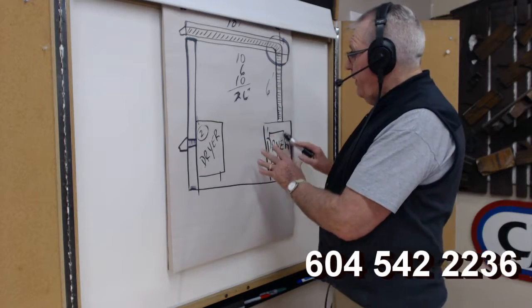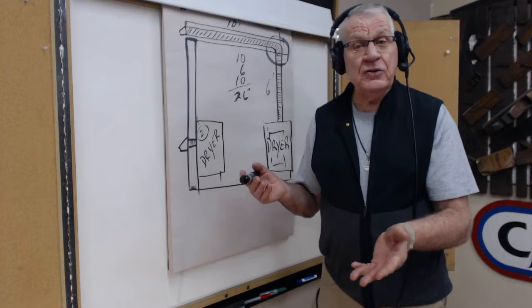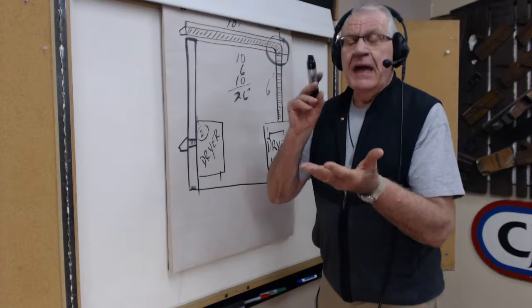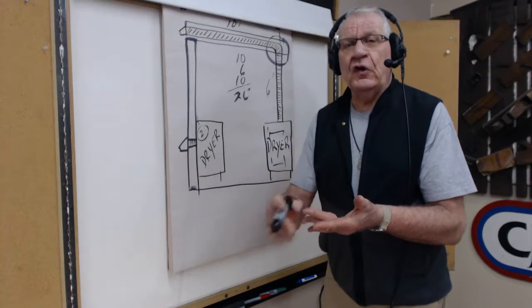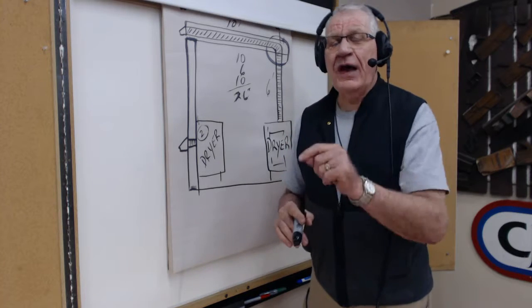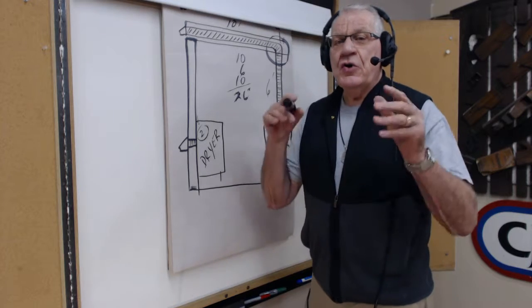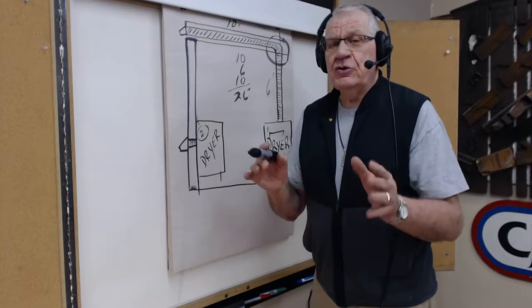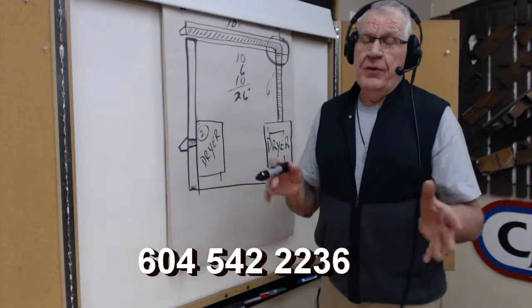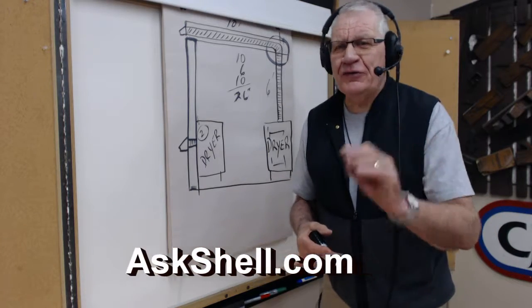And the dryer being located further into the home, maybe in the laundry room, maybe even in the kitchen or up in the laundry closet upstairs, whatever the case may be. Length of ducting is so important, and you know what? There's no code. Okay, so always ask when you're looking at a new home or a new residence, make sure your ducts are clean, make sure your ducts are not too long, and if they are long, you're going to have a poor efficiency factor out of your dryer. It's just that easy, folks.